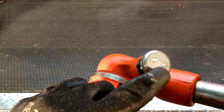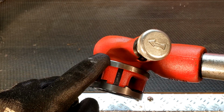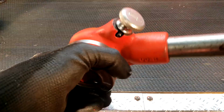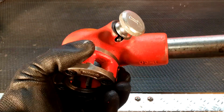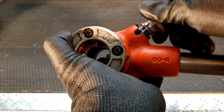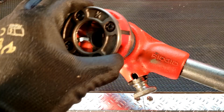Note that the direction the arrow is facing refers to the locked or unratcheted direction when rotating the handle. Because we're fabricating right-hand threads, you'll want the ratchet to lock when you rotate the handle in a clockwise direction, as viewed when facing the pipe end. For added flexibility, you may insert the die assembly on the opposite side of the ratchet as well.